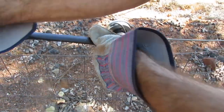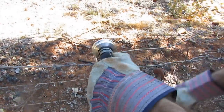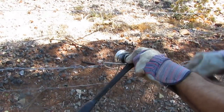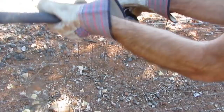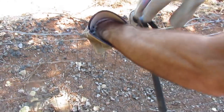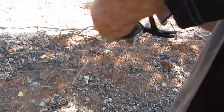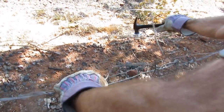To un-tension it, you give it a little more and you roll it back on itself — like this. This pinch will hold the tension on the wire. It's best to keep your hand on it like this when you're unrolling it to keep the wire from slipping. Once you have it unrolled, you slide your hammer off, give it a couple wraps, and there's your patch.